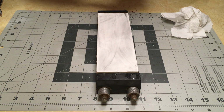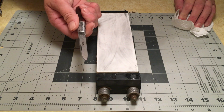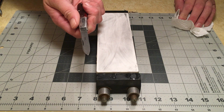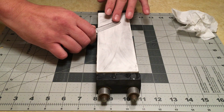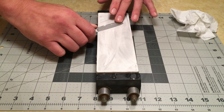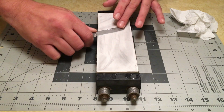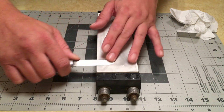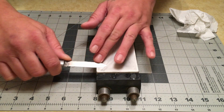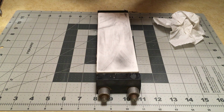Well, grinding it at the same angle, the bevel is actually going to be smaller on this side than this side. So I've got a choice. Either I can grind it asymmetrically or just keep the same angle. So I'm just going to try to make it look as good as I can, but keep the same angle. Traditionals are so thin, they can be notorious for having off-center grinds. If you guys saw my traditional video, I had this problem with my Viper, and it was really bad on that one.